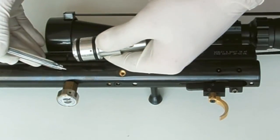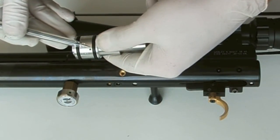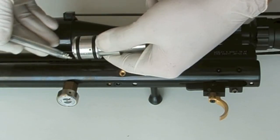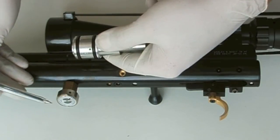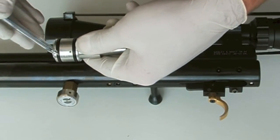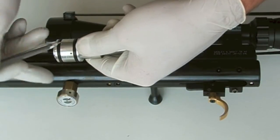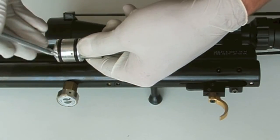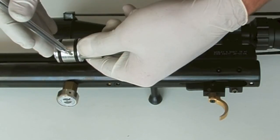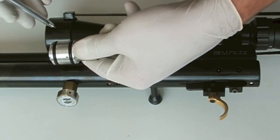This is far bigger than the one to three millimetre hole we recommend for your air regulator fitting. The pressure gauge assembly is very similarly held onto a piece of aluminium or brass block with a hole in it, and then this screws together. Just like with the regulator, it's a block with two O-rings on either side, and that's standard practice.